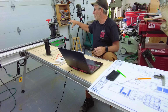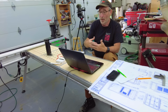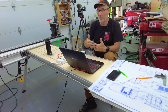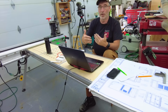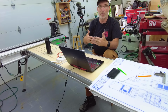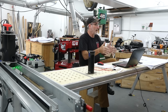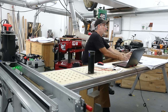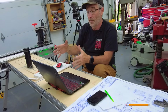And this has new technology built into it within software and hardware, called Yeti Pilot, and it monitors spindle loads 50 times a second. It will adjust the speed 3 times a second. So if I say I want to run at 100% and the machine is bogged down, it's too heavy, it'll drop all the way down to 10%. Or like when I'm cutting, I do slab flattening with this.